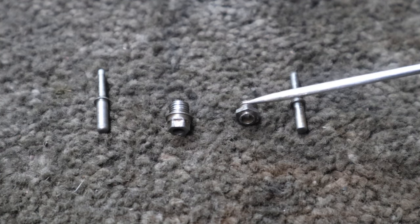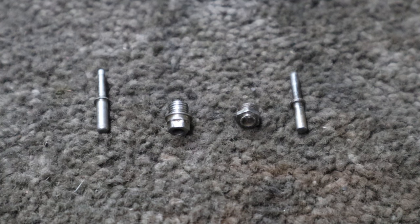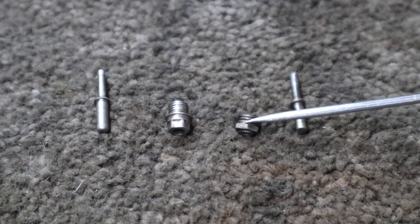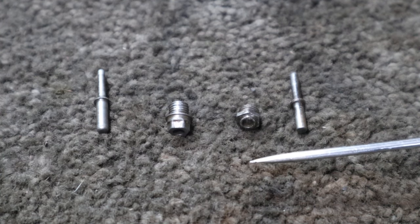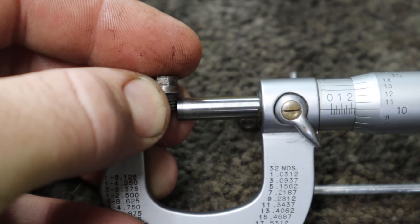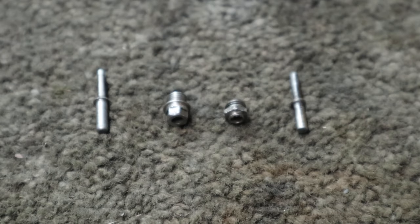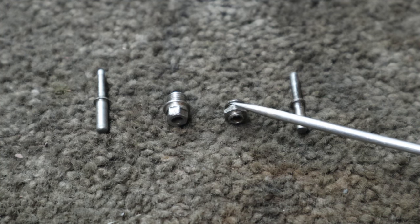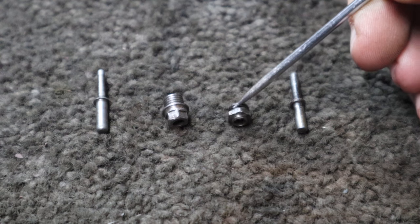You can see that the form factor on these two is quite different — this one looks really small, this one has a much bigger head on it. What I believe they have done is this has been made from an old grease nipple, and I'll tell you why. This here is 32 TPI, this here is also 32 TPI. However, these are actually two different sizes. If I mic these: 0.235 and 0.252. So a 0.235 by 32 TPI and a 0.250 by 32 TPI — this is a quarter-32 grease nipple.